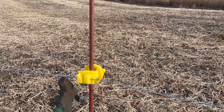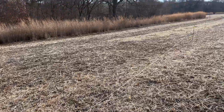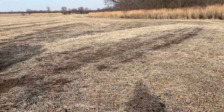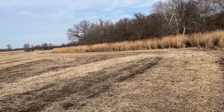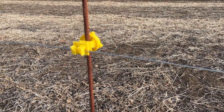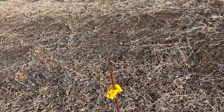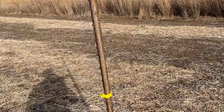We got her back up — let's see if that fixes the problem. Nope, not really. Found another spot that's grounded out. Turns out there's five posts in a row where the wires are on the ground — you can hear it grounding out. Got those fixed. Testing again on the steel post now — those painted posts sometimes don't give a great connection when testing. Yeah, I like that. We're good.